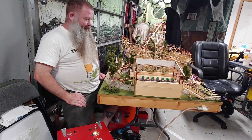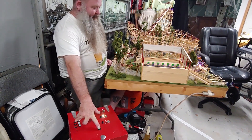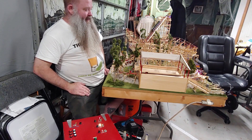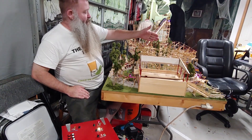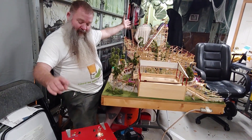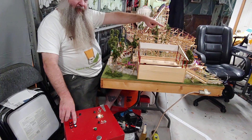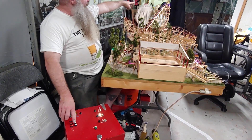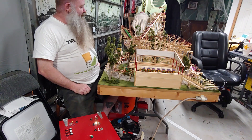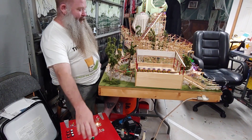For testing purposes I can manually set a block to occupied. I'll dispatch the train and tell the station there's something in it. Because the brakes have advanced and the lift has reached the top, it won't go further. But I can clear the station and everything will happen on its own — it'll pull in the train on the brakes, which clears the brakes and allows the lift hill to advance. One button clears the station and the whole sequence triggers.